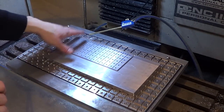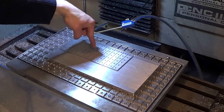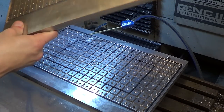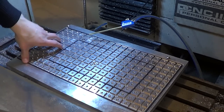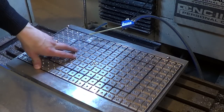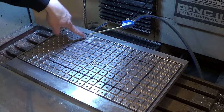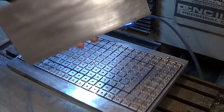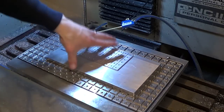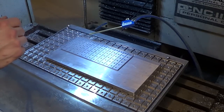Here's the fixture that I just made. It's basically a simple O-ring on the outside, and the holes are just clearance holes. This hole right here is my vacuum hole — I have to manually drill that all the way through. On my big vacuum grid here, this fixture is a copy of Mighty Byte's vacuum fixture, just made bigger. I have little M6 screws — two on the top and one on the side — which just gives me positional accuracy so I can take this off and put it back on, push it up against the stops, and know it's nearly exactly where it was before.